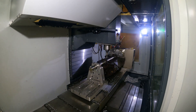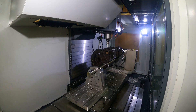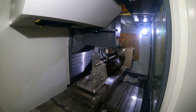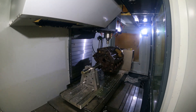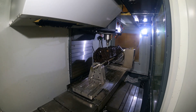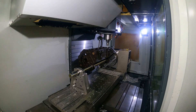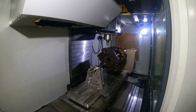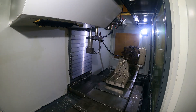The first thing we do is probe the block out. We probe that bar that goes through the mains to set our y-axis. We probe the dowel pin hole on the bottom. We level off of the oil pan rails and then we're probing the deck right there to just check the deck surface, make sure everything is within tolerance of where we want. Now we're going to go through and probe all the individual bores. Basically we're trying to set this up just like the factory would have wanted it but with a lot better equipment and a lot better machines.